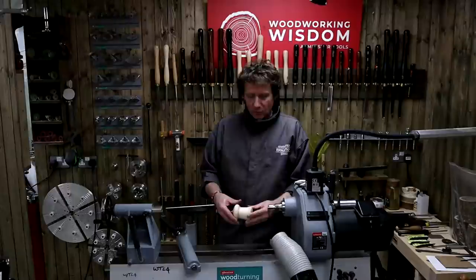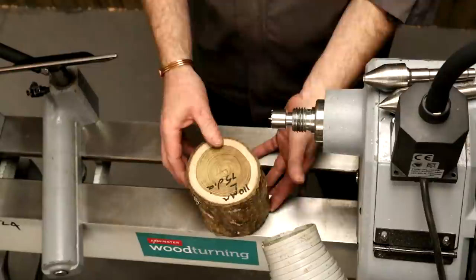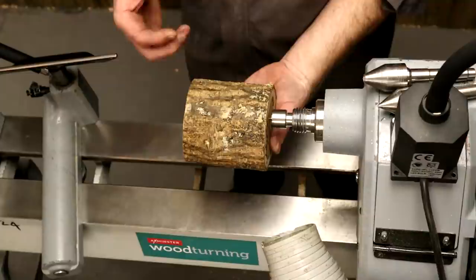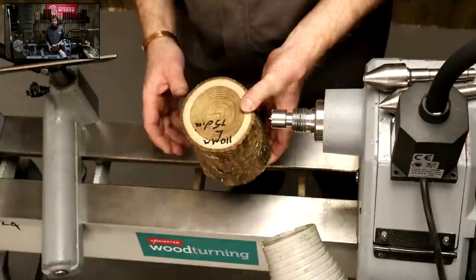So we've got our wood. This one's a bit rough, so just bear with me. Got our timber - this is a piece of laburnum. You don't have to use this, but I need something that is dry, well seasoned. We're going to work spindle work for this, so the grain is running with the orientation of the lathe bed. It doesn't have to be a log material - it can be something like a bit of ash. Someone's going to say it's a bit toxic - I've got an air cleaner going. When we sand, we're going to have the extractor going.